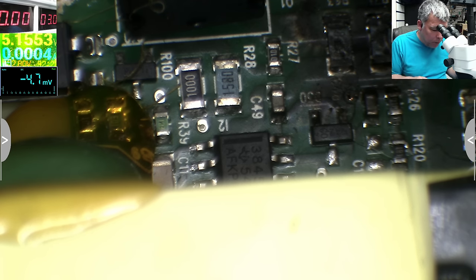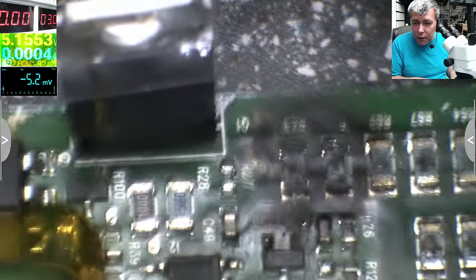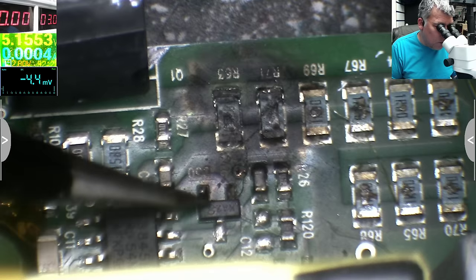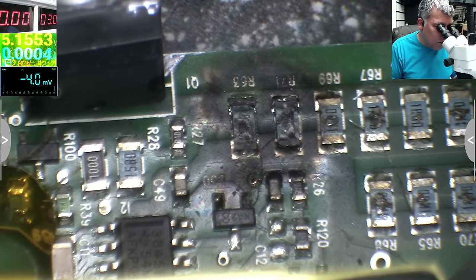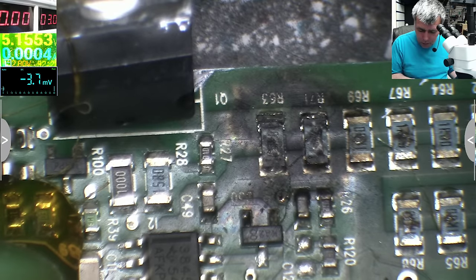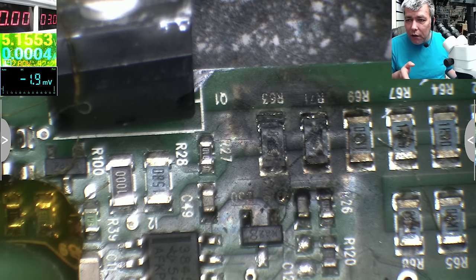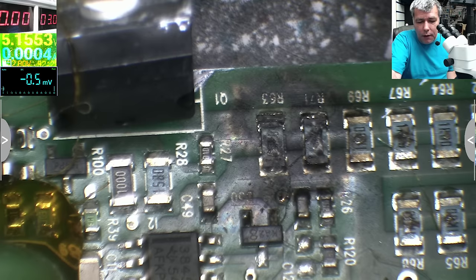So what do we have here? We have a lot of burnt things, yeah? The problem is, if your main MOSFET, which is this one, is burned and those resistors, most likely the chip is gone also. But the problem you have here, some small transistors, probably MOSFETs, which, I don't know, maybe even that's more scary, because how will you find them? Probably by the code you can't find them. But that's not the idea. You try to fix something which failed, yeah? So everything is gone on this power supply for some reason, yeah? So let's go a little bit with basics, yeah? Basics, 1 second.